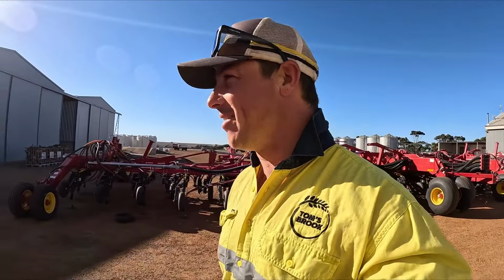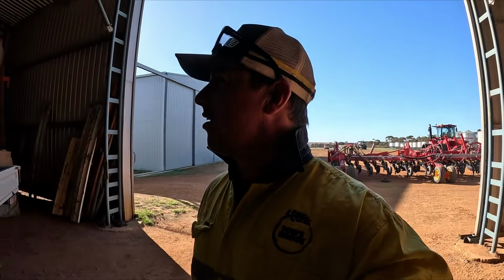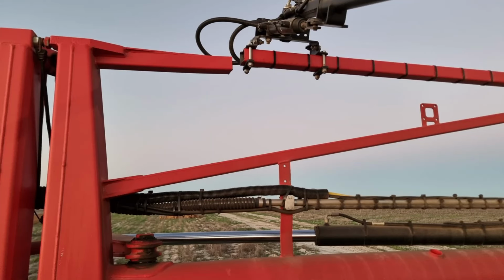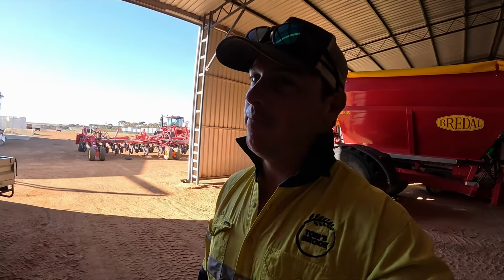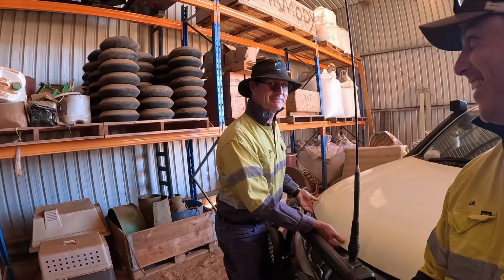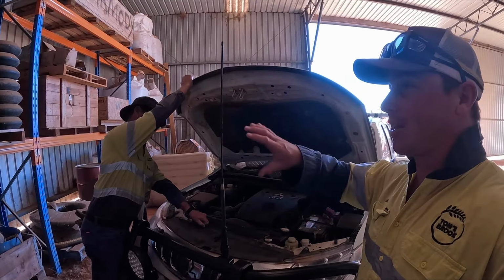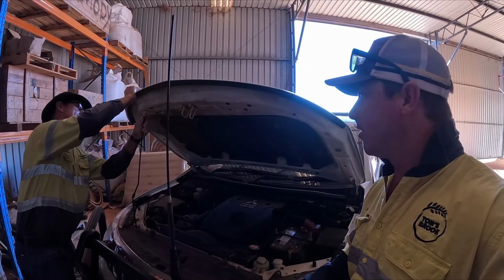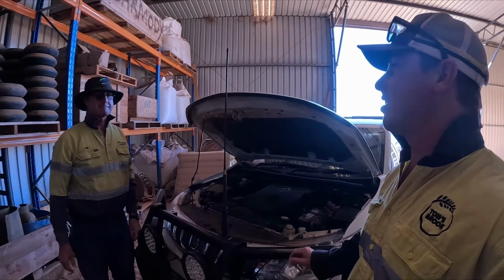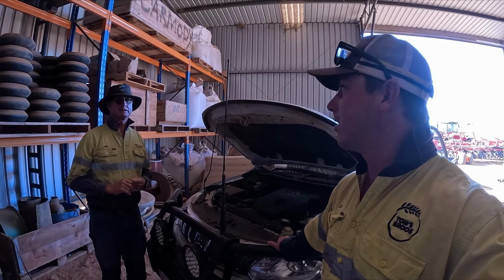So typical whilst I'm away, exciting stuff happens. So Henry, I'll put a photo up now, was spraying and the truss on the AgriFac broke, which wasn't ideal. So we got Julian out and welded it up, and Dad and Henry had a lot of fun with that. Fun, yes, I forgot how good farming was. So much fun. So they had to get the boom level with the telehandler, and welded it up, put some gusseting around, and he's spraying now, so it worked. So he was only out for, I guess, 4 or 5 hours. But yeah, that'd be about all.